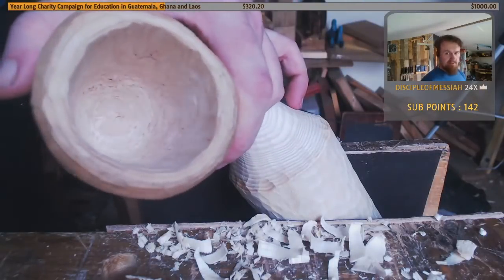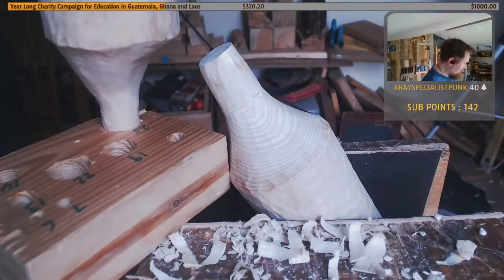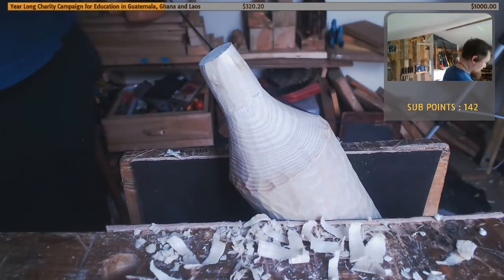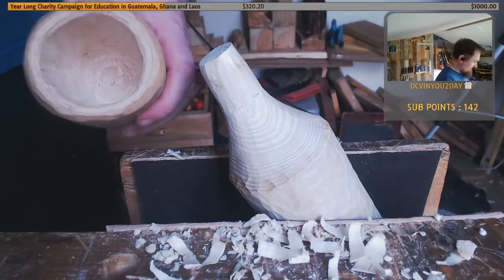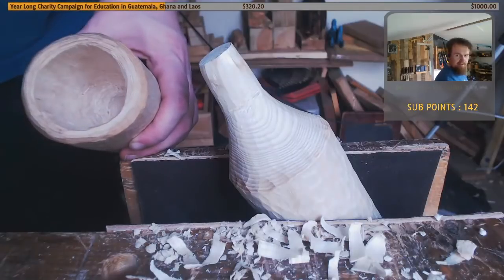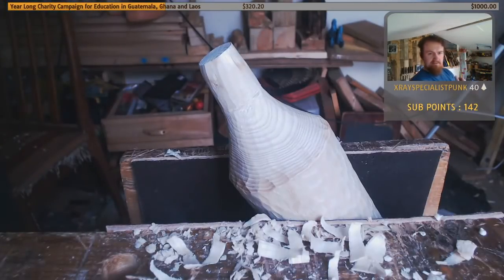They're tool holders, so they're going to be pushed into a piece of wood. So not this piece, but imagine this is the piece it's going into. They're going to be going in like that. I drilled a big hole down the center with an auger bit. Then I chiseled bits out and kind of broke them inwards. So I put a chisel down like the edge here and broke them that way. And then I got a scraping tool and scraped. It's a bit of an ordeal, but it worked out.